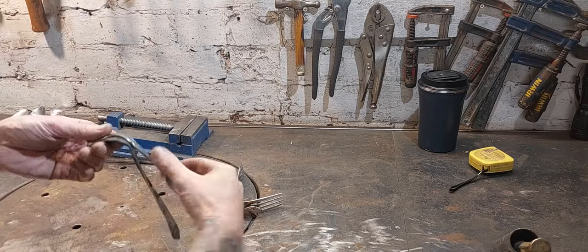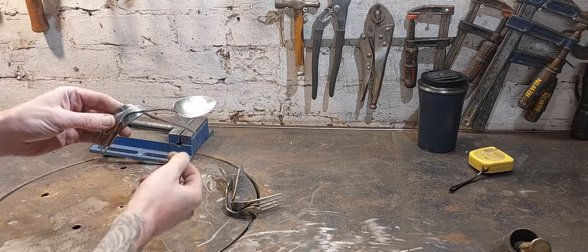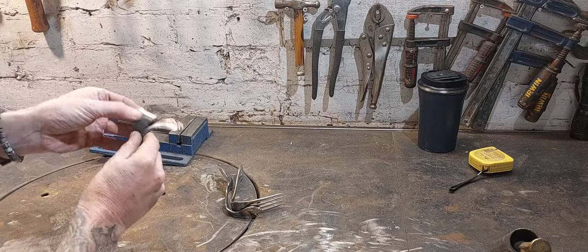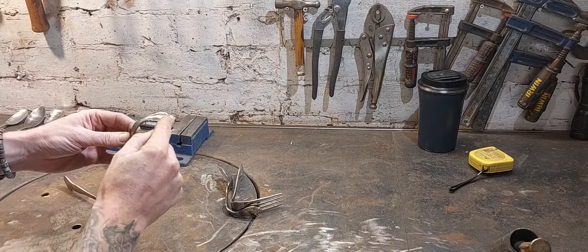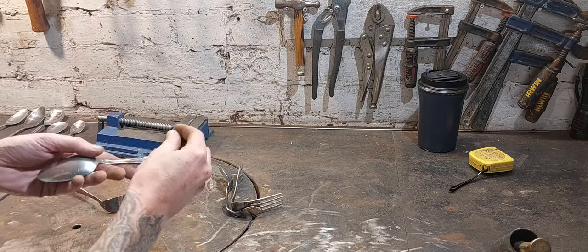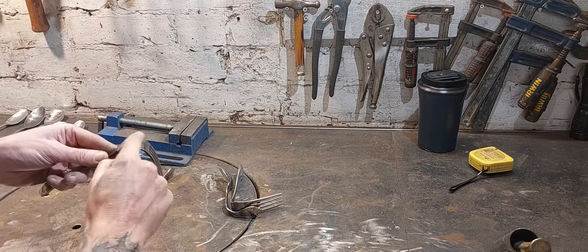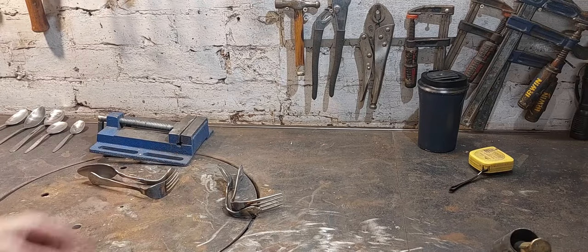Okay, so see I've got quite a nice fit there, but what the heat does obviously is put a sort of nanoscopic tarnish on the top, these sort of yellows and reds and blues. So I need to get all that off. I can do that with a polishing mop. There's also a few little marks from the hammer which I need to get out, so I will do that with